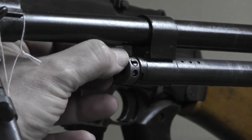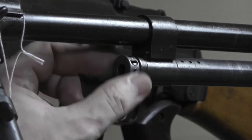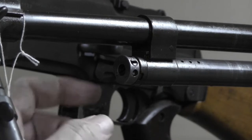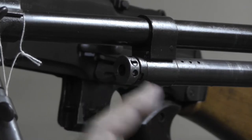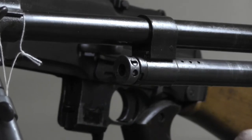I have to use a center punch and punch it open, then it comes out to the side and this whole little assembly screws in. Recently I purchased some magazines, and in the magazines was a gas tube assembly that had a much later gas adjustment, which I'm actually going to retrofit to this gun because it makes it so much easier to use. Even though this gun is close to a World War One gun, the gas system is just more practical for use with all the surplus ammo I shoot.